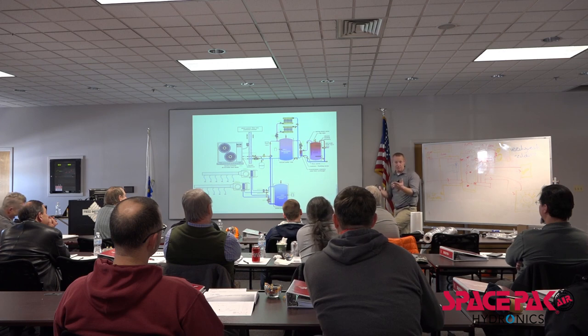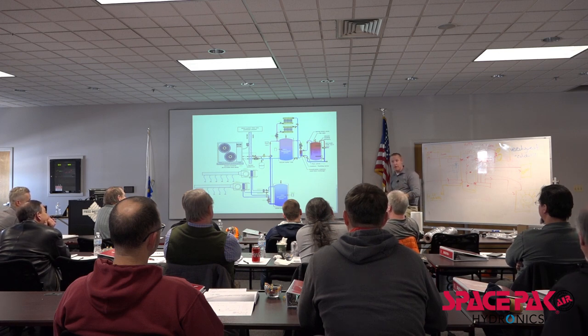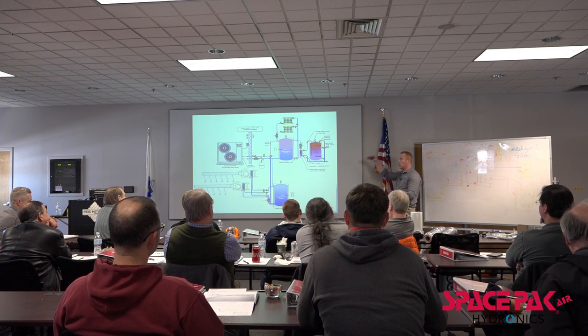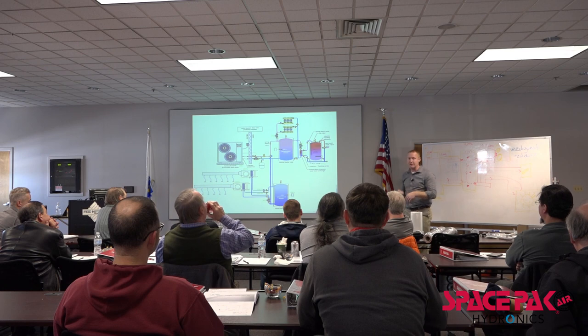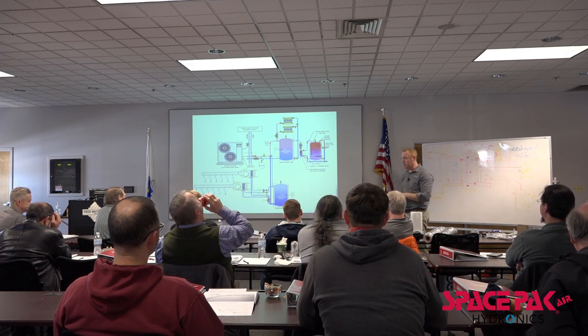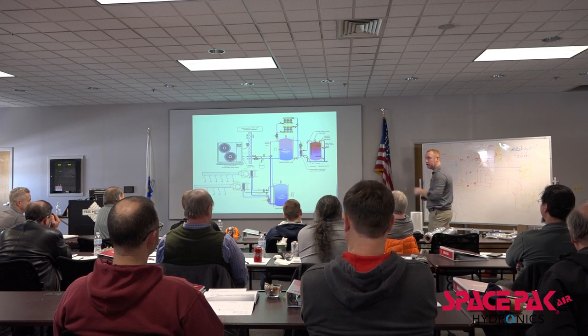Do you know of any company that makes a low temperature indirect storage tank? They're all based on high temperature water. It's the only way you're going to get your transfer and your recovery rate, because we're trying to make 120 with 180. When we make 120 with 130, it doesn't work so well. It will eventually, but it'll never keep up. That's why we just recommend not to use it as that primary source. We can help it out, but we don't want to hang our hat on it for good.